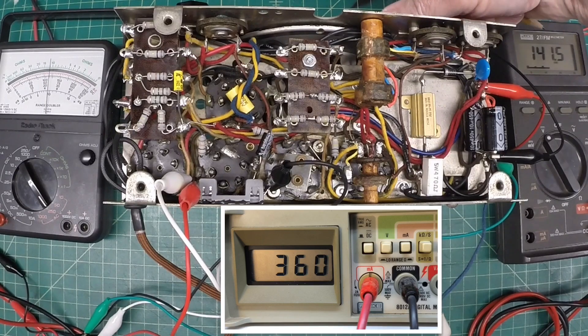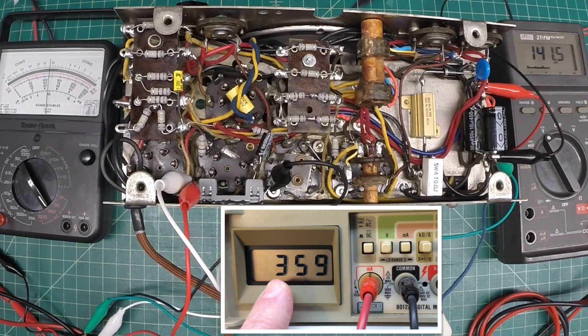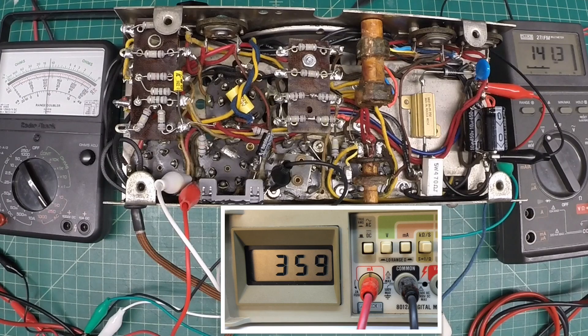Okay, that's it — we went through the full range. I'll continue to keep an eye on B+ voltage and definitely the current, since I've got the fuse out of the radio. I'll provide maybe one more video with a touch on the RF alignment, and I had some questions about what size fuse I'll use as well. Let me make sure I don't uncover any other issues, but I'm very, very pleased here with the first power-up on this Silvertone radio from the early 1930s. I appreciate you guys following the series along with me. Thanks again for watching.